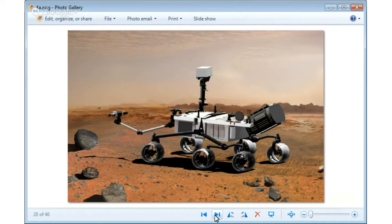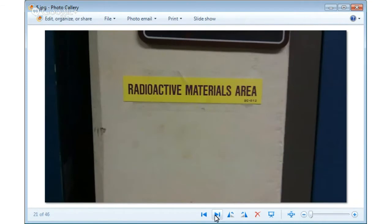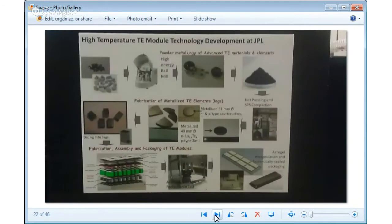As you see in the picture, the back part looks like a canyon coming out — that is a radioactive thermoelectric generator. This is where I work, in the reactive materials area at Building 277. We construct this high-temperature module here. We fuse silicon germanium at high temperature and high pressure until we create these pellets. When you apply a temperature difference, they can generate a flow of electrons. We stack so many of them that we can generate up to 400 watts.